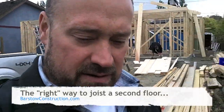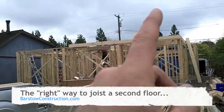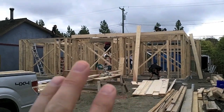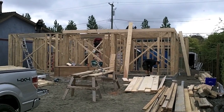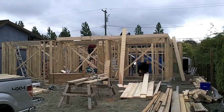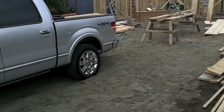Good morning. Monday morning, we're just over on our single family lot. What we're doing here today is we're lining up and laying out all the joists for the second floor. This is our third day of framing. Walls are all up in the first couple of days and braced, leveled, racked. Now we can lay the joists on the second floor. We're putting the joists in, which will create the ceiling for the first floor and the floor for the second floor, and then we can go from there.